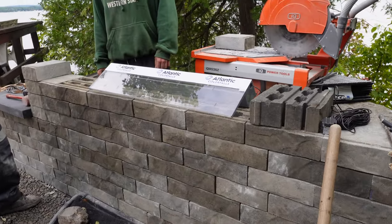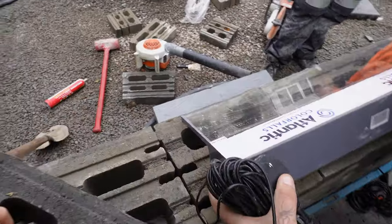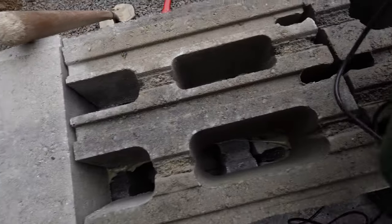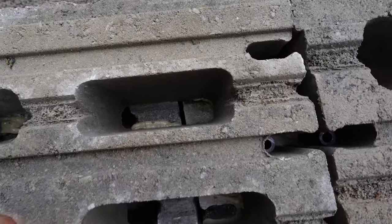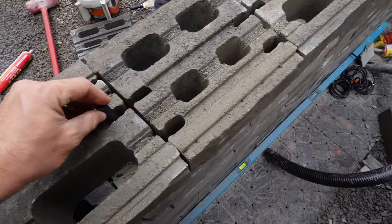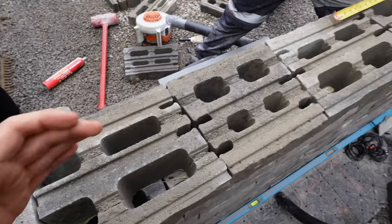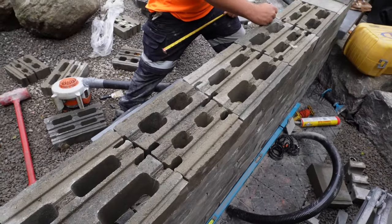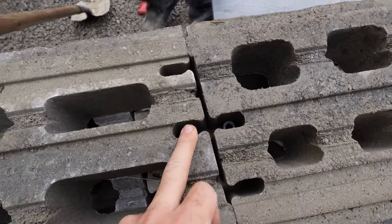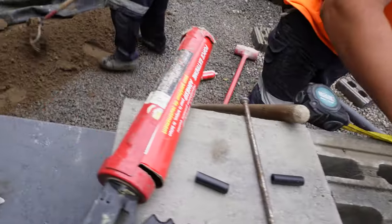And then these walls, guys, in case anyone's curious to know, when you build these walls, these tabs, this goes on top. So you look down below, you can see in these gaps here, there's pins. You can see them down there. So you glue, you bond the row, and you use these pins here. They go down in there, and then we use this little tool just to seat them in place, and that kind of holds that wall and locks into position. But also wedge pieces, so the wedges themselves hold the wall together. And then you have the tab, which helps you keep straight, and it does hold it together, and you have your bonding down below. So this is called a Techo-Bloc random wall.